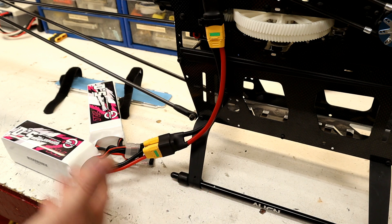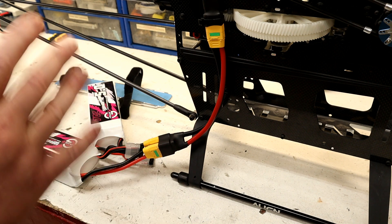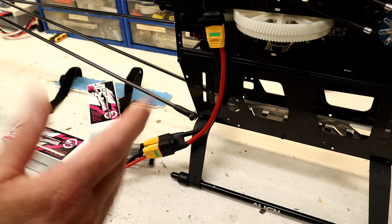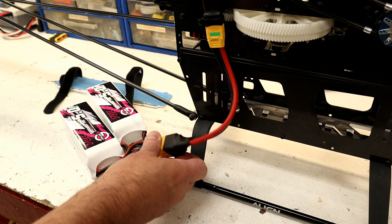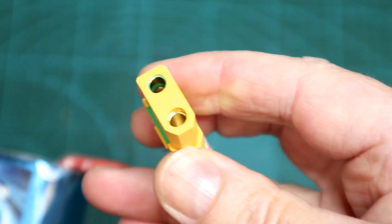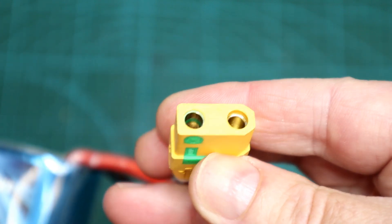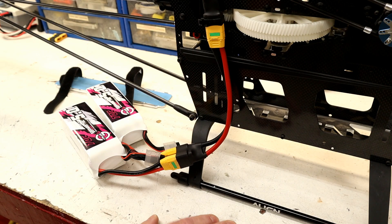That's anti-spark connectors. Hopefully, if you didn't know much about them, now you can gauge whether or not it's something you'd want to use. Again, 6S and up — the higher the voltage, the bigger the spark. I really started noticing it on 12S plugs; I was replacing plugs basically every season and got sick of it, so that's why I've gone to them. Here, for example, is an anti-spark connector that has got probably about 70 to 75 flights on it, and as you can see the sleeves have no carbon pitting — they look essentially brand new. Thanks for watching folks, happy flights and we'll see you next time.